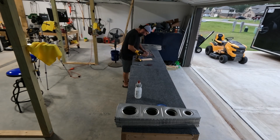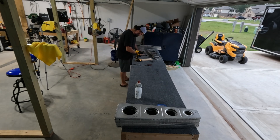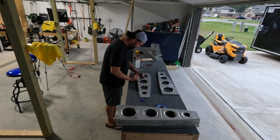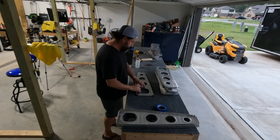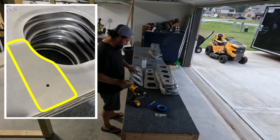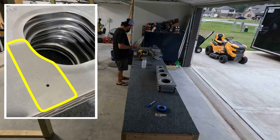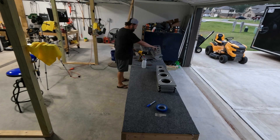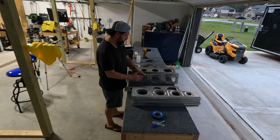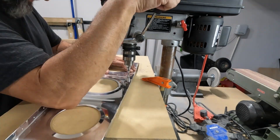There are 14 main ribs per wing. What I'm doing here is marking where I'm going to drill that three-quarter inch hole for the conduit. I marked one, drilled a pilot hole, then created a little template — you can see me working with it here. All you have to do is line that up with the bottom of the rib and with the edge of the lightning hole, and that pilot hole will be in the same spot on every rib. I marked all of them and then drilled a number 30 pilot hole. The ribs face different directions, so you just flip that template over for whichever direction the rib is facing.